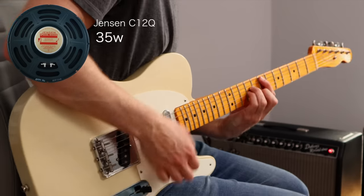In general - and it is a generalization - low powered speakers tend to have a lower volume and they sort of encourage the sound to be more overdriven and coloured. Higher powered speakers tend to be louder, harder sounding, cleaner and more attacking. So using a lower powered speaker might help you lower the overall volume just a little bit to a slightly more manageable level.